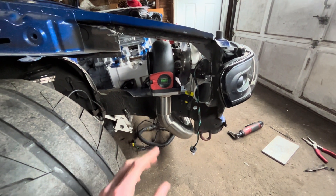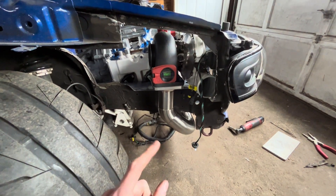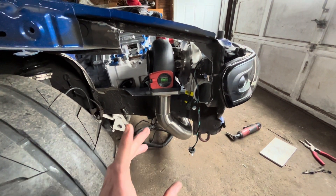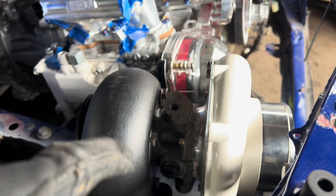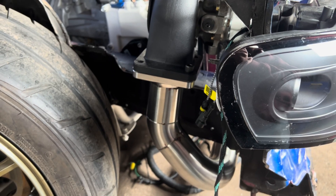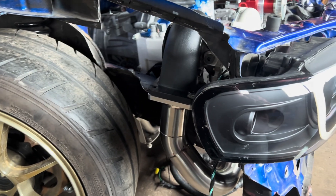We'll go over some points on the welding and some of the big things. For a more detailed explanation, check out my How to Weld playlist — there are five videos on how to weld stainless steel exhaust in that playlist. This video is more on the start-to-finish fabrication. Also, I want to point out that this turbo is pretty large and heavy, and there are just a few fuse tacks on each joint — only three on that V-band — and those three tacks are holding the weight of the entire turbo and tube. Do not underestimate the power of tacks and put too many on when you don't need to, because they're a pain to break.